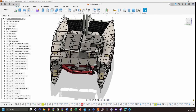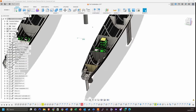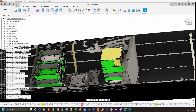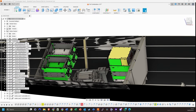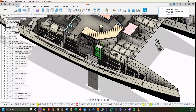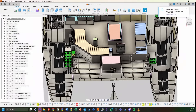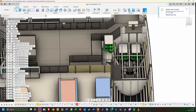The initial design has the batteries in the engine compartment under the bed — they're not interfering with the motor, but they're all together. Now we are looking at alternatives due to weight distribution and the delays we had with the new fit out of the catamaran. We might put them right next to the tech room, which gives better weight distribution — they'd be sitting flush with the mast on both sides, so the point of balance and gravity should be better.